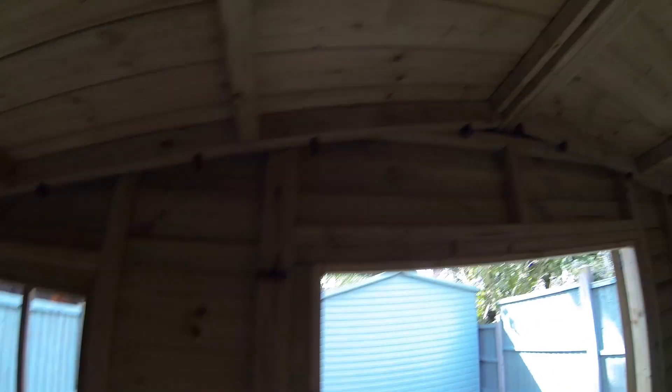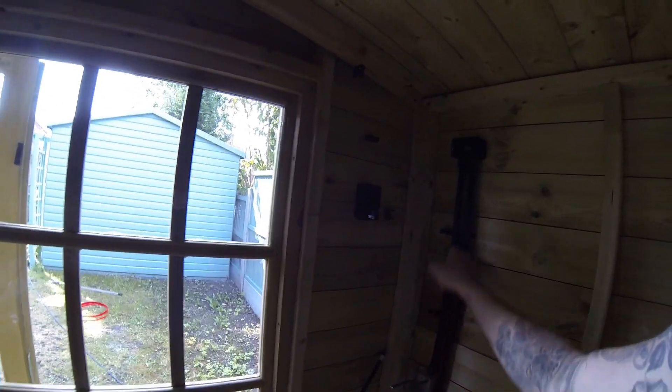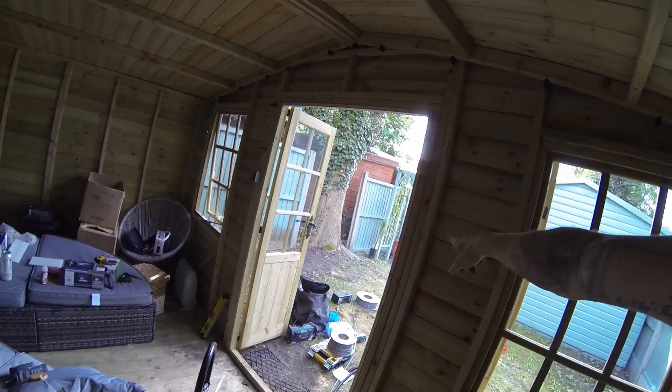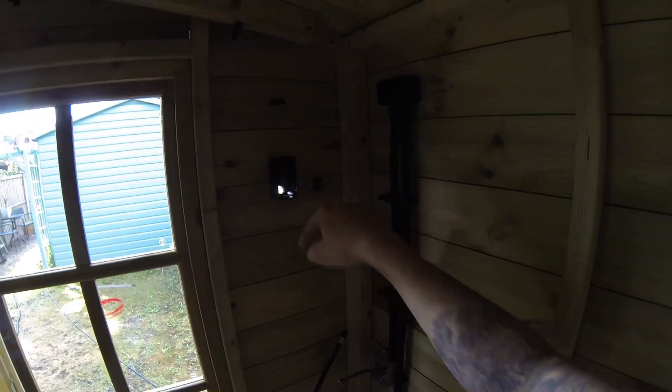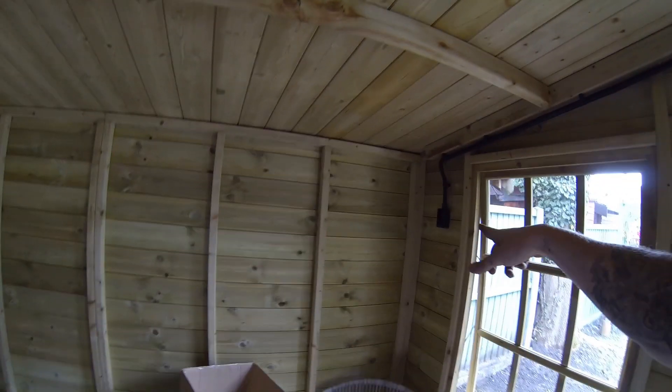Clicks up, clicks across, saddles across and down. These are pretty handy because they have a joint strip so you can slide them together to get nice and neat close joins. They'll spread out slightly as they go through into the fitting. Everything spaced evenly. Next I'm taking a feed from here to here with a short bit of flexi conduit, keeping the continuous loop up and across, and at the same time pulling a length of 1mm off and running that through with a rod to bring the switch return back through the same ducting.